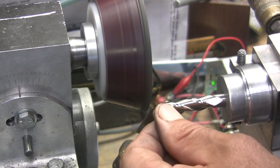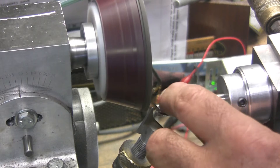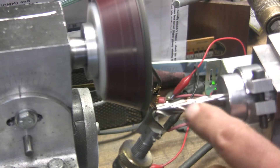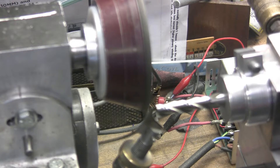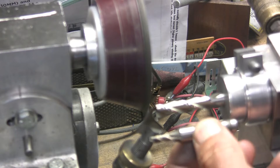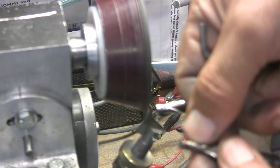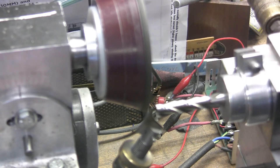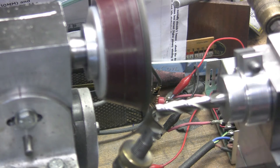The reason I'm doing extra passes is because of these chips. They're gone. All you gotta do is unload it and you've got a sharpened end mill. I've gone down to 3/16" diameter sharpening. At 3/16" diameter you don't have much room for your finger to ride on, so I would have to reset the finger. But I'm just doing 3/8" right now. Anyway, that's how it's done — that's how I'm doing it — and it seems to work out pretty darn good.